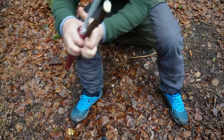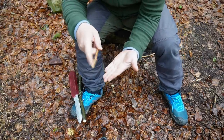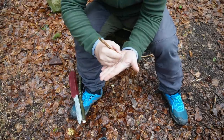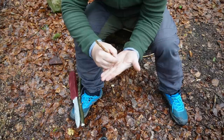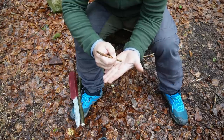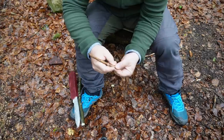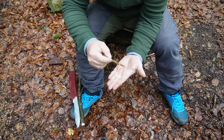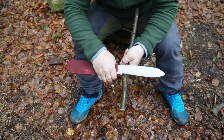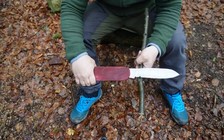This is similar to writing your name on a piece of paper. You hold the pencil very close to the tip and you can write your name perfectly. Now try going back three centimeters and write again — and you realize you lose control. The farther away from the tip you hold the pencil, the less control you have. It's the same while carving: if you carve very close to your hand, you have maximum control. If you carve farther away, you have almost no control.